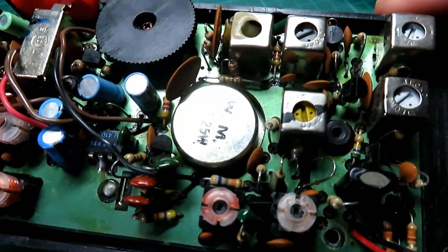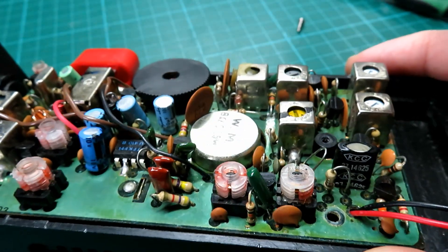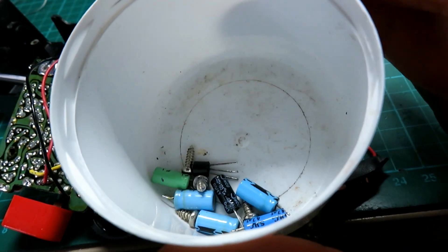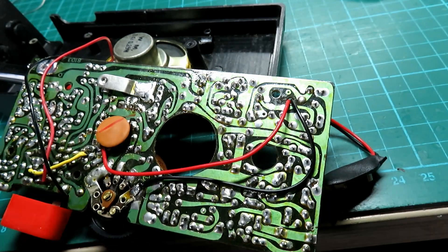We can see there are four capacitors on board — five in total. I wasn't hearing any audio problems on these and the volume seemed punchy enough, but perhaps it might be wise to swap those capacitors out and put some new ones in. You can see that this one has receded a little bit — see the way the plastic is towards the top of the can. I'll take one of those capacitors out because it does look a bit troublesome and we'll get it on the tester. Right, I've changed all those capacitors — the green one was the worst, had gone quite high.